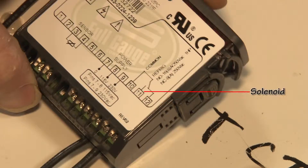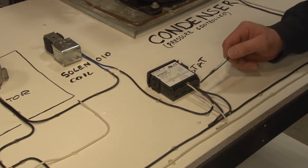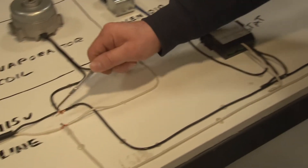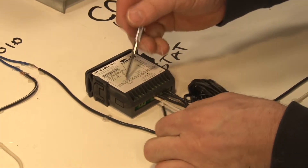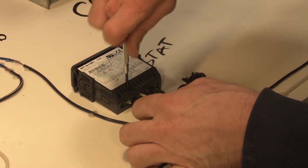Here's one more look at those connections. All I need now is power to my controller, and I'll get this from a neutral and a hot that come directly from my 115 volt line. I'll tighten down the terminals for my power wires. And the last thing I need to hook up is this temperature sensor right here — it just goes right into these two sensor terminals, like all the other wires. Tighten that down.